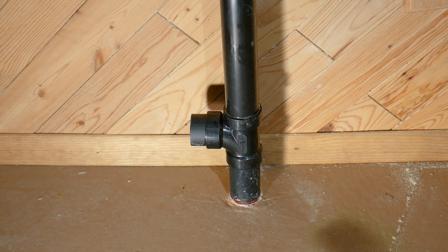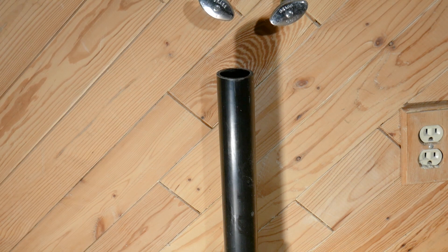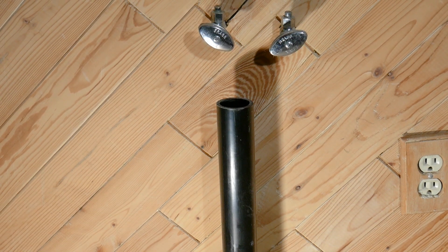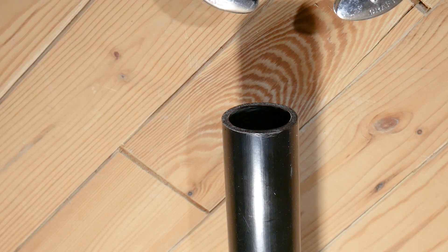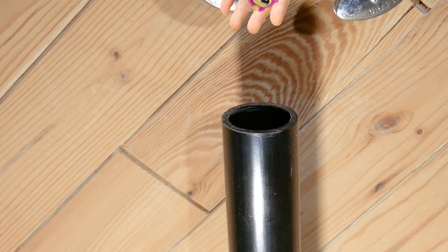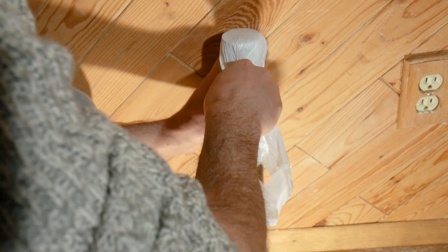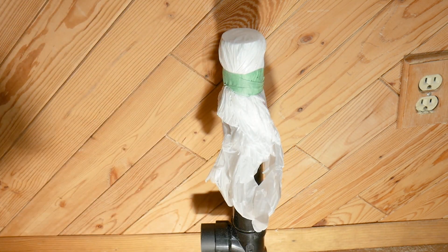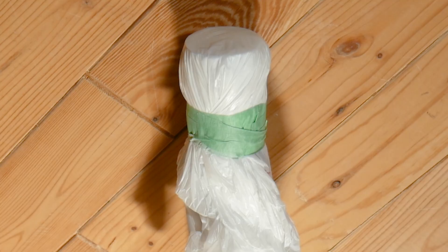Number six is one of my pet peeves and it's cutting a pipe and not capping it. If you cut a pipe, no matter what the situation — vertical or horizontal — never leave it uncapped. Reason number one: you'll have sewer gases coming in and have the place smell like rotten eggs. Or number two, someone could put something inside the pipe and that could get quite costly to repair. If you don't have cheap caps on hand, just grab a plastic bag, triple it up and use an elastic or tape to hold it in place — it'll add a layer of security and it won't smell weird.